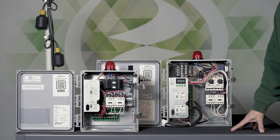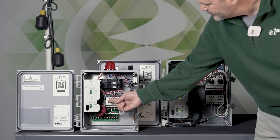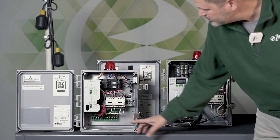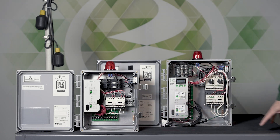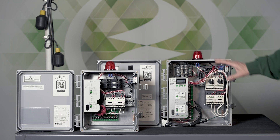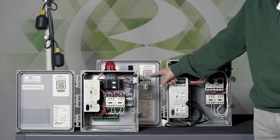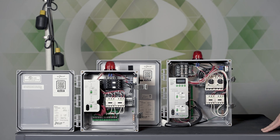That's a brief overview of the Pivot Pro. The Pivot is very similar — you just don't have a screen, the logic board is smaller and doesn't have a place to plug in a gateway for Z-Control, and there are not as many features on the terminal strip. Pivots are also usually in a smaller enclosure. But the most important thing to know is you can easily get to any information — including an alarm table that shows you how to resolve alarms or what they mean — right there at that QR code.